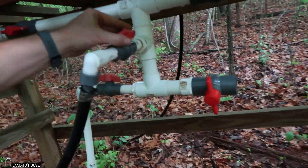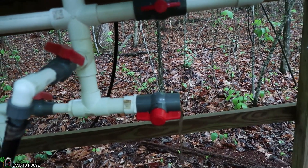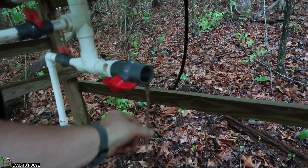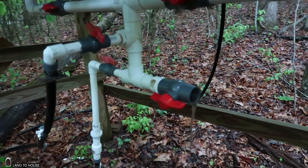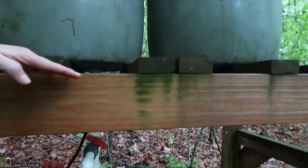What I want to do is close this so that down to the garden is not open, and then drain that little bit that had made it up here. That should be flowing pretty consistent there. I'm going to close this, start the timer, and we will go again. The water is already here and we'll begin filling the tanks. We won't have to fill this 200-something foot, three-quarter inch pipe, so our test will be a lot more accurate now.